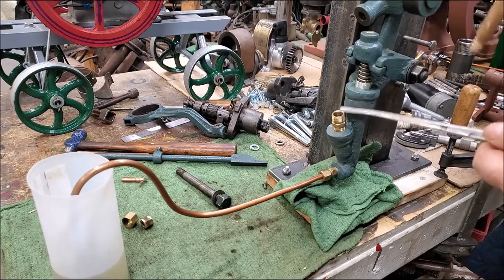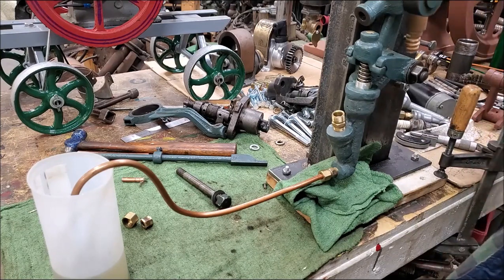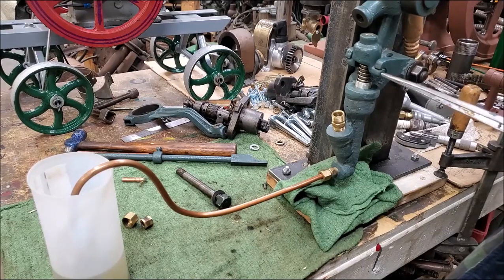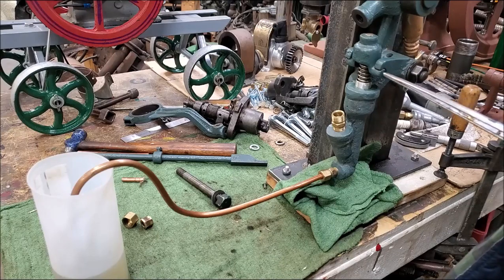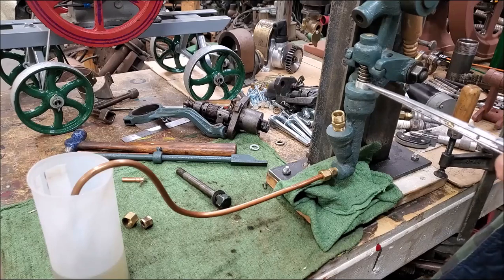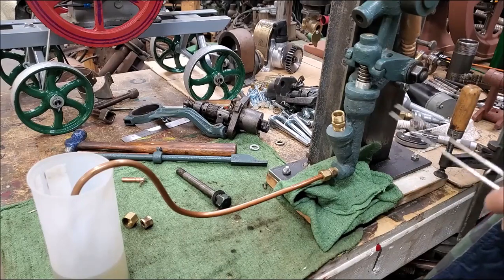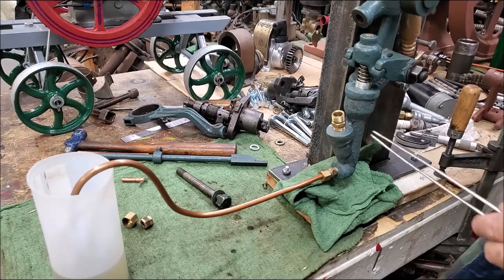This area right here is where the fuel line to the mixer would be attached - keep an eye on that part. I have a dowel up here in the mechanism that will mimic the roller cam to activate the plunger. This part here is not in factory specifications at all. Whoever the initial builder of this fuel pump was - there are good parts on it, but it's the sum of the total. If they had started with a good casting, machined a mounting surface, and then went from there, I think they would have had a very good item.